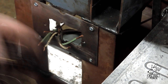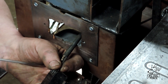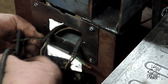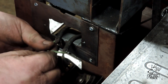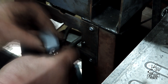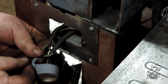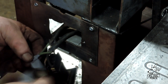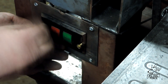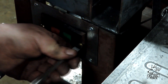This is our switch off of our makeshift bench grinder we built — should power this thing up pretty well. We'll use the blacksmith scissors to trim that insulation back and just some electrical tape. I didn't have a wire nut to put on there, but we'll give it the old wrap and fold and re-wrap and it'll work out just fine. We'll put a little strain relief on this so the cord stays in place and so you don't trip on it and yank the electrical cord out.